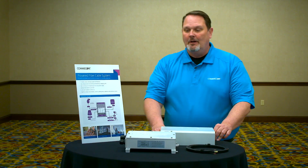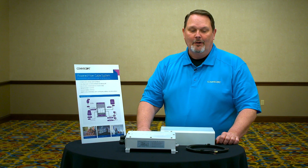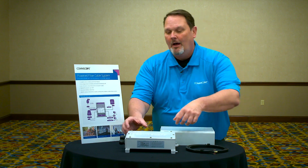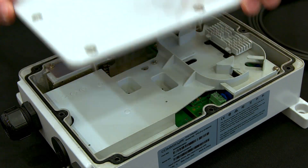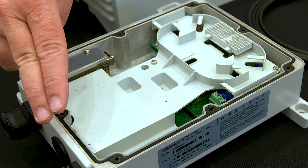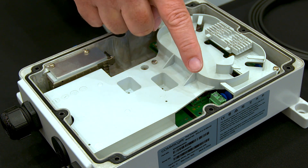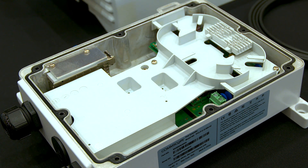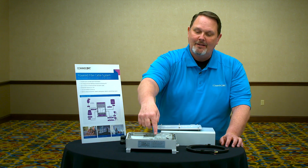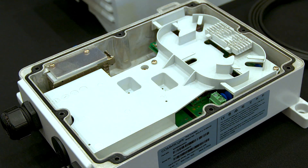For the simplicity of installation, we run the fiber cable from the building out to the installation environment. As mentioned, the fiber cable has two copper conductors. When we terminate the cable inside the PoE extender, the cable enters through a weather sealed grommet for weather protection. The copper terminates and lugs down onto the terminal strip for power delivery, and the fiber is fusion spliced using a fusion splice tray on top with splice protection sleeves. Those pigtails then connect into the SFP for network connectivity.